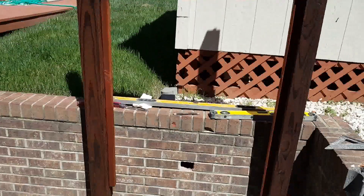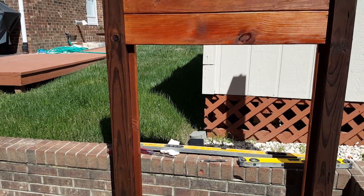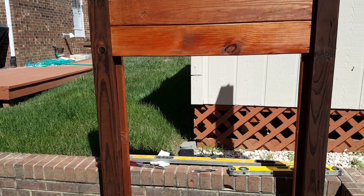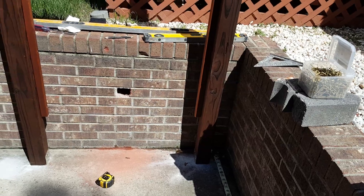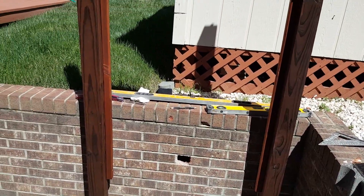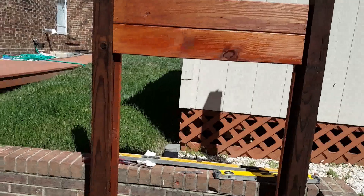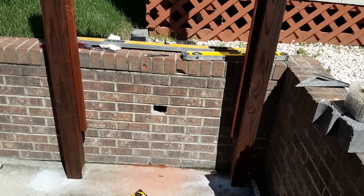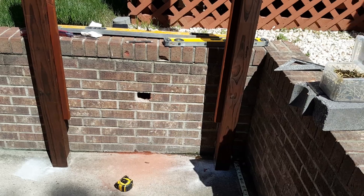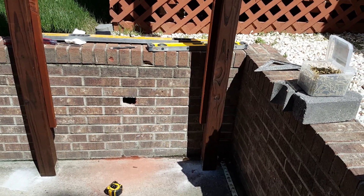The first board is being installed. I have that two-by-two in the back — it's 56 and a half inches long — for the ten boards we're going to install, sitting about 14 inches from the floor. That gives you the privacy you need when you're taking a shower. We're going to add some decoration on top, but we're putting it nice and straight, level. Notice that we have the hole over there for the water lines, so let's continue assembling the first panel.